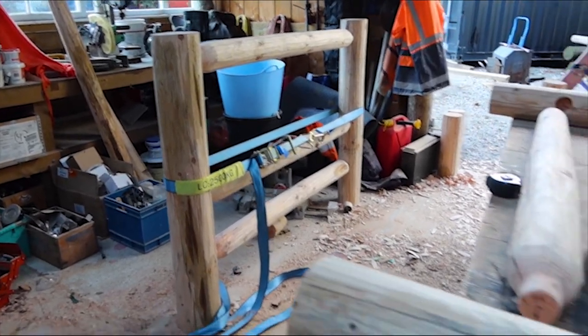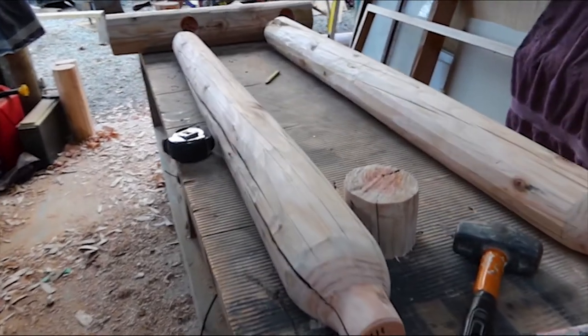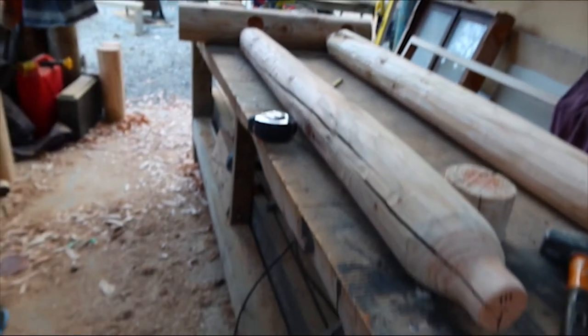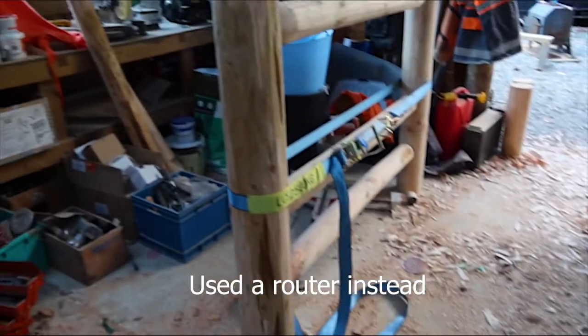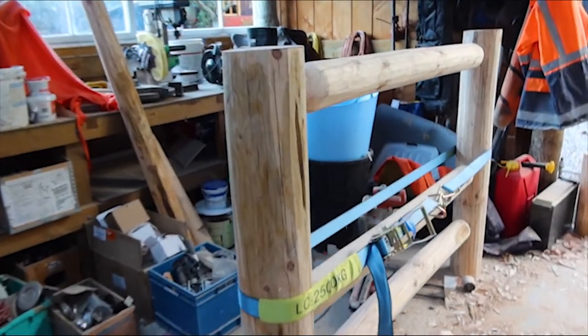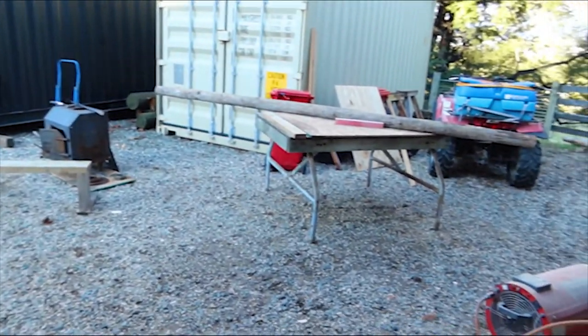The main two frames are all done. I've tested them as a dry fit — they're fine. Now I'll mark them all up to make sure we have the correct ones, take them apart, sand them down, and sort these ends out. I'll chamfer these off with the draw knife on top and bottom, and I've got maybe four or five verticals to put in there from that old pole.